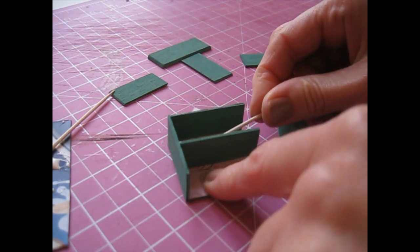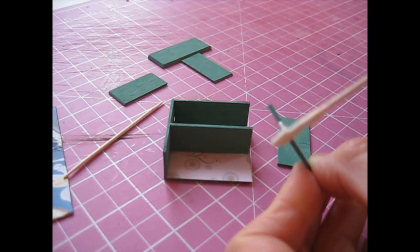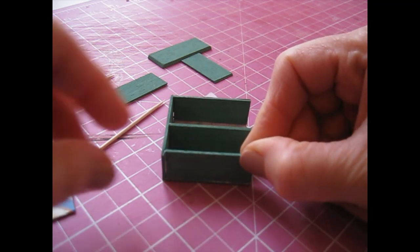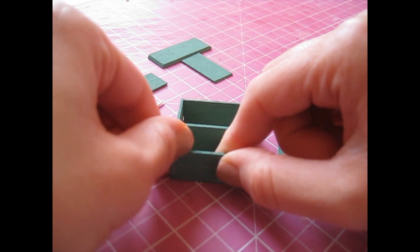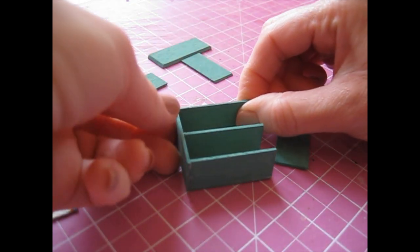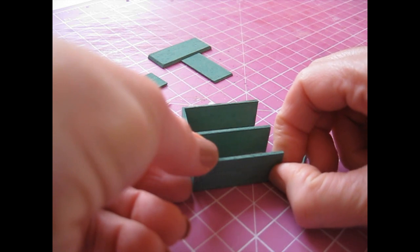The final of those three pieces becomes the bottom piece and sits on the inside edge of the joined pieces. Apply glue to a short and a long edge, attach it, and make sure you've got a flush line along the bottom and press it right into the corner. If the top shelf pops out a little, push it back in — the glue hasn't yet completely taken so you can do things like that. Always look around to make sure everything is staying where it should.